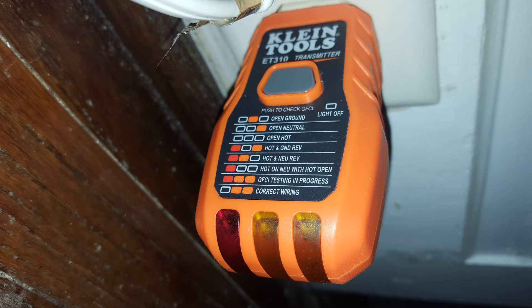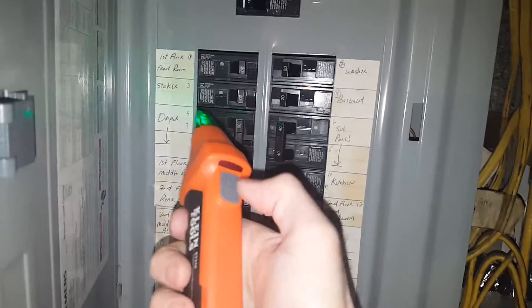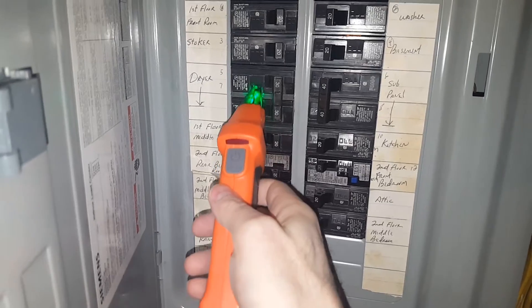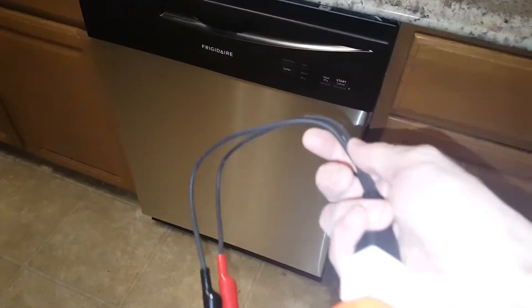You can see — hit the button in the back. I'm going to take my Klein Tools digital circuit breaker finder down to my circuit breaker. This is my electrical panel. You may not have them labeled, which is one reason for getting this tool. Press this button and it's trying to find — and there you go. It beeps, so then you know that this is the circuit you want to turn off, and you can press this back in to turn it off.